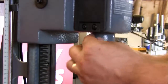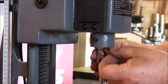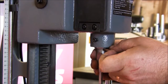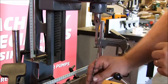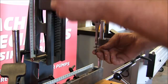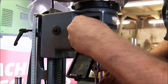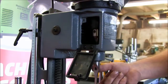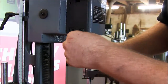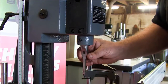The chisel itself is slid in by releasing the allen key holder. A good tip is to have a penny and slide it between the shoulder of the chisel and the actual machine — just tighten this up finger tight. Having inserted the hollow chisel, the bit is then slid through that and up into the Jacobs chuck and pushed completely home. The Jacobs chuck can then be done up tight, securing the bit. At this point we can now raise the chisel bit using the penny which positions the bit in the correct position for the hollow chisel.